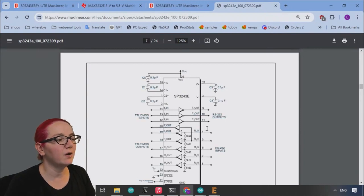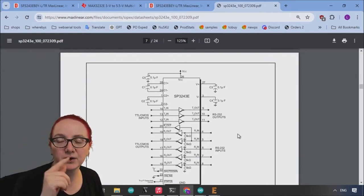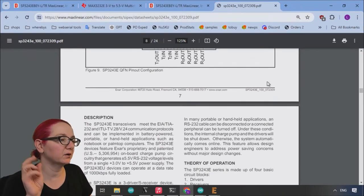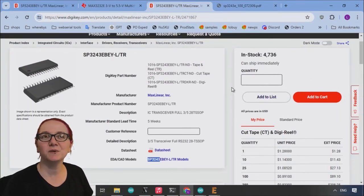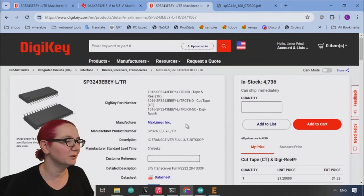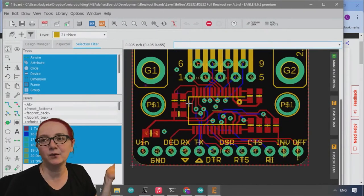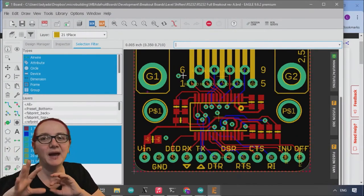There's also an R2 out, which lets you monitor the ring input even when the chip is shut down — so if something is ringing you, you can wake up the modem or wake up your computer when the modem rings. It's funny to look at USB serial converters and see that the DCD pin is still there, even though it's a weird thing for a USB device to do. Anyway, this is in stock for under a buck, and you get all your transceivers. Basically this is the chip I'm using. Anything with the 3243 — SP, TRS, MAX — you're good to go, no matter how many RS-232 connections you need, with 3 or 5 volt logic compatibility. This is my pick.